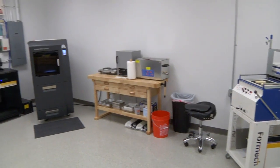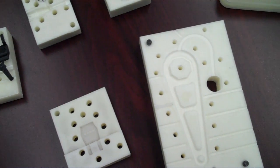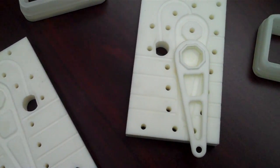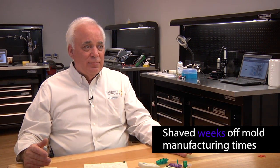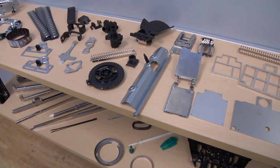To get an insert-molded part in two days, you wouldn't even get close with a machined mold. To get this kind of quality traditionally, you'd buy a metal mold — it takes two to three weeks to make, costs six to seven thousand dollars depending on the part. We were able to take the exact same part and reduce the mold manufacturing time from two to three weeks down to a day, 12 hours. If we get files in the afternoon, we can ship parts the next day.